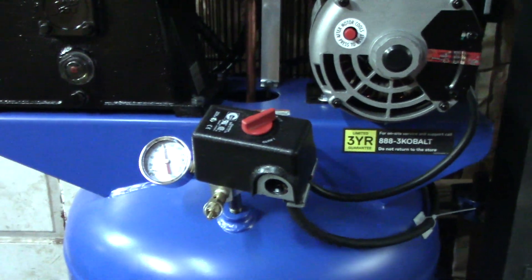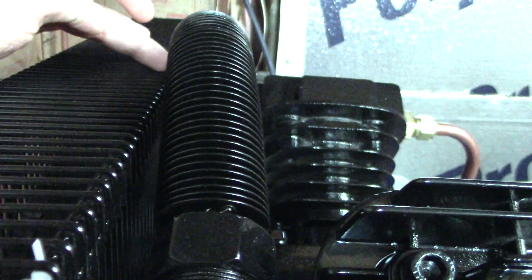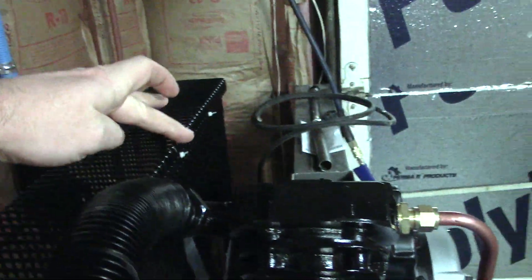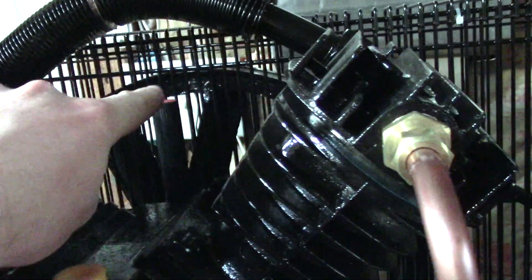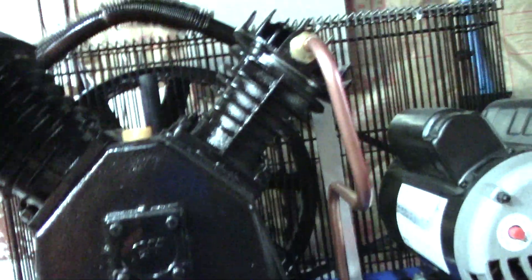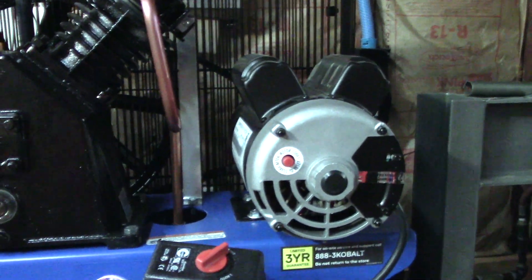When I first turned it on there was a little vibration from the cage back here — a small clearance issue between the cooling tube and transfer tube. I fixed it simply by putting a zip tie here and another zip tie here, which tightened the cage up and stopped the rattle. One thing I don't like is the flywheel on the compressor pulley; it's a casting and could have been machined and balanced a little better. I would have gladly paid 20 bucks for that, and I may try to balance it myself later.